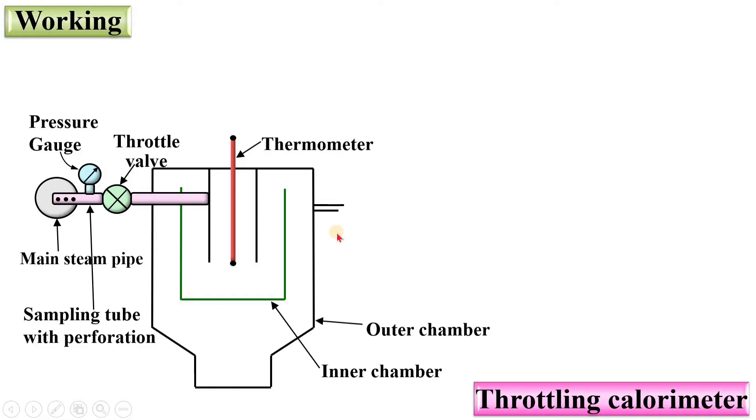The outer chamber is also connected with a manometer, sometimes known as a U-tube manometer. The manometric fluid is provided here — generally mercury is used as the manometric fluid — and this whole device is known as the U-tube manometer. Now let us see the animation.